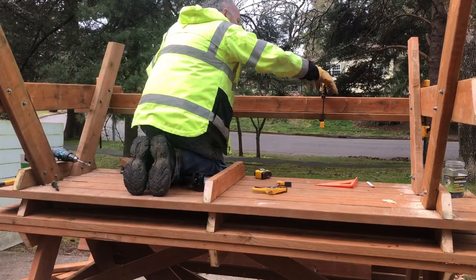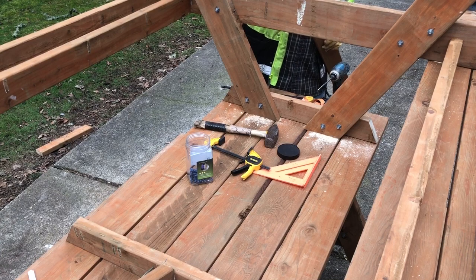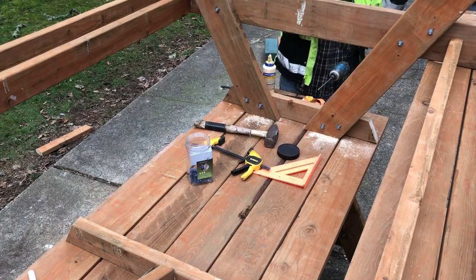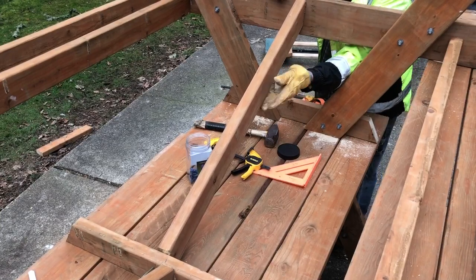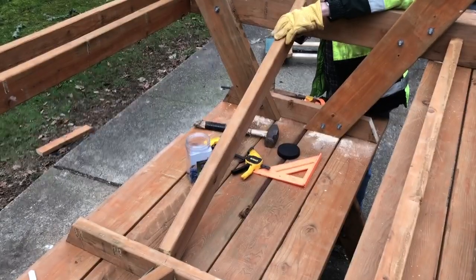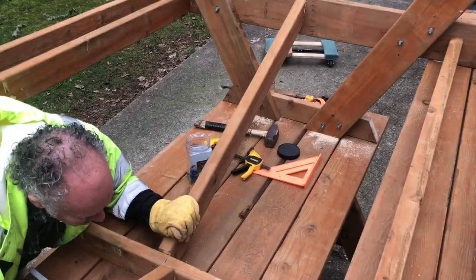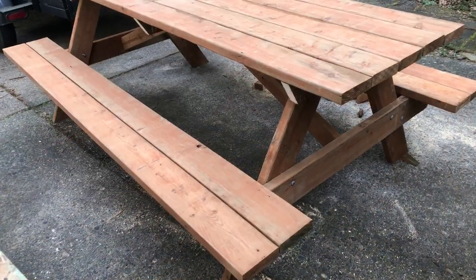After repeating this on the other side, I've already got one of the braces put in. I put glue on the end of it — this is the board that should be at 22 and a half degrees instead of the 20 degrees in the instructions; it just fits better. We run two screws on each end, staggering them so the center line is on the edge of each board — one from one direction, one from the other.